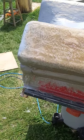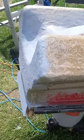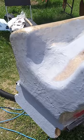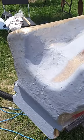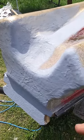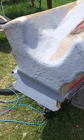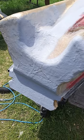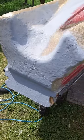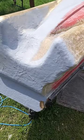Now I'm going to tell you about fiberglass and making things out of fiberglass. Most bathtubs and stuff are made out of it. What they do is they make a mold first and make sure it's perfect. Then they coat it with a silicone so when they put the clear coat on and the acrylic on it, it doesn't stick permanently. And they have these little things they put on in between so they can put air to it and it pops it off the mold.